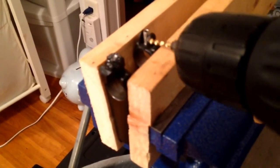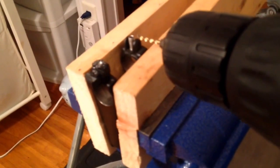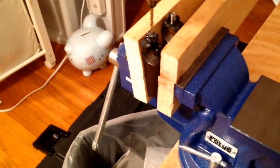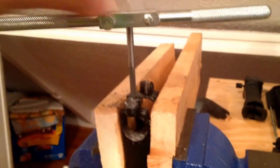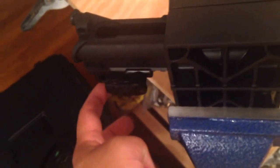Now I'm getting ready to drill my second hole through the bayonet lug, which is a little over half an inch thick. One thing I learned from the first hole is that my hole wasn't entirely straight vertically, even though I was basically just slightly enlarging an existing factory hole. This time I put my barrel assembly in, made sure it was level, and I'm using a drill that has a simple little level device on top to help me stay straight. The second hole came out mostly straight and I don't foresee having a problem with it.